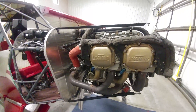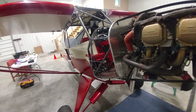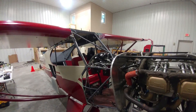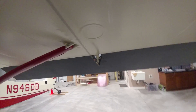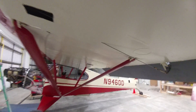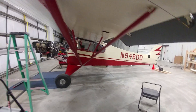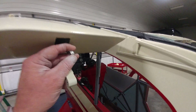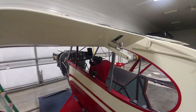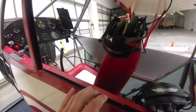The engine was primarily in low time and really good shape, so it didn't need a lot of work. This also has the 2,000-pound gross weight upgrade kit on it, which is mostly things that go into the wing, plus heavy-duty bungees down below. I've been working on getting the ailerons hooked up — still need to put some paint on the ailerons but been running the cables. I poked this hole and it's in the right spot, so that's good news. The flap cables are all connected, so just the flaps themselves need to be finished, painted, and installed. The new window channels are in place and the windows will go in real soon.